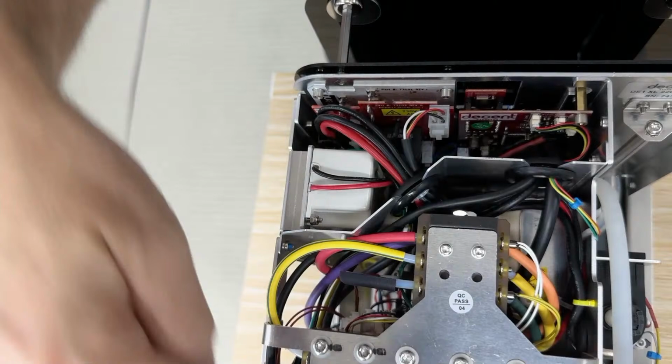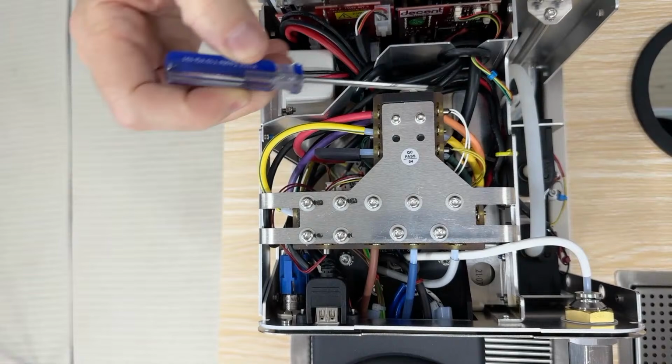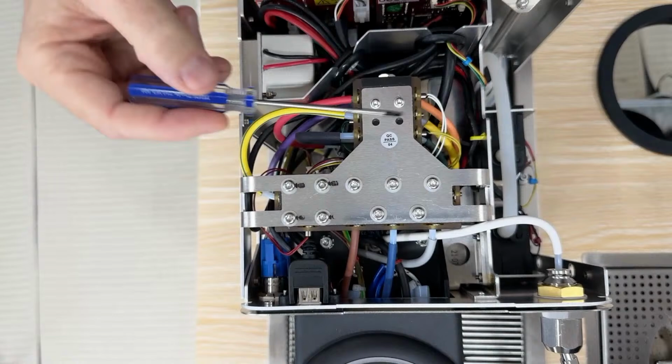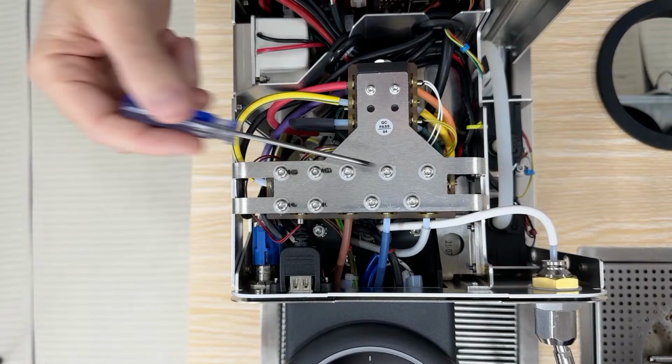So when it powers up, we turn on each component separately and we measure how much current each of those components is taking. So we can, and we do, turn on each valve separately, each pump separately, each heater separately. And if anything is using more current than it should, so for example, if a valve is calcifying up, we'll be able to detect it and fail the startup. So that's a quite neat little trick that I like quite a bit.